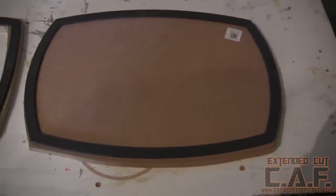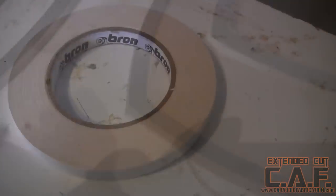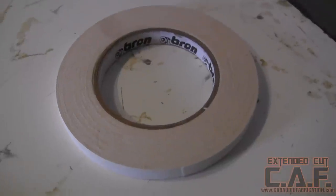All right, so you can see here that I have my baseboard, which is made out of half inch MDF. And then I have this insert, which is actually made out of 3/4 MDF. And the reason for that is it's gonna sit about here. And I actually have 1/4 inch plexiglass that I'm gonna side light that I want in there. And then this piece will fit down within there. And once again, that's made out of half inch. In order to prepare these for the router, we will do our normal sequence of applying them with the double-sided sticky tape.